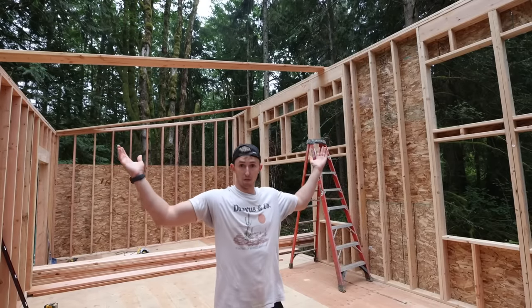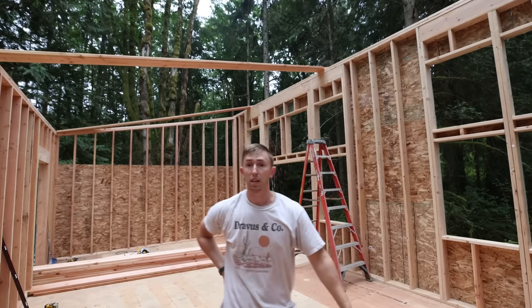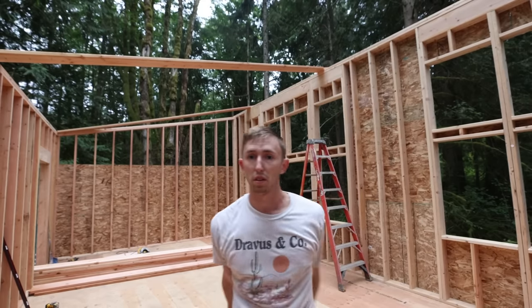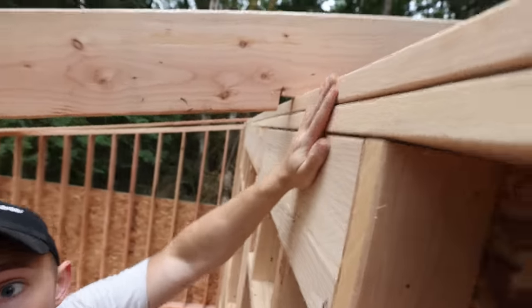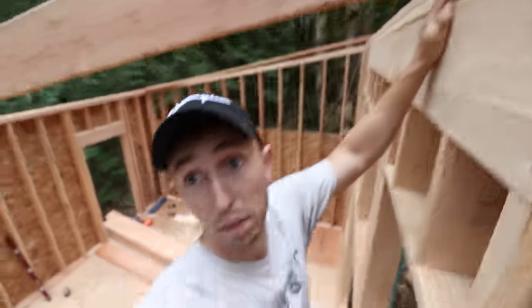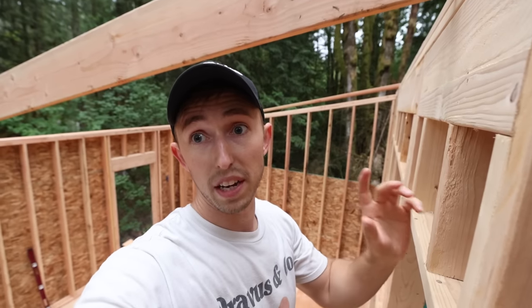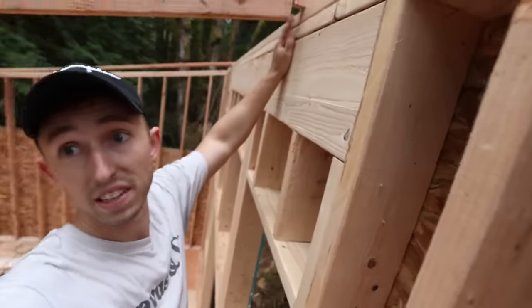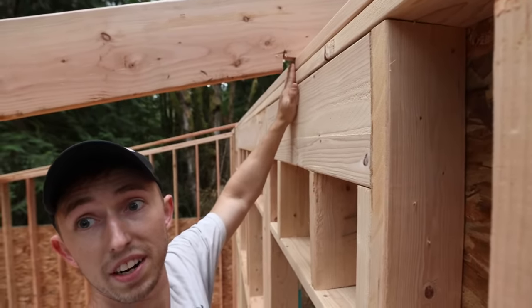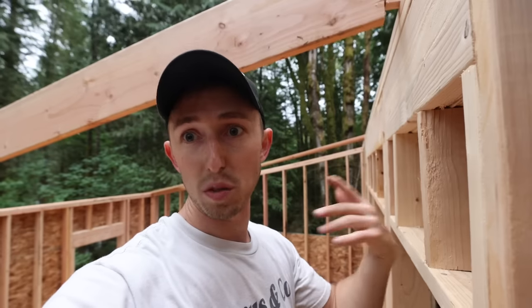I thought these walls flare out a little bit at the top in the middle, so I think I'm going to have to ratchet strap them and pull them together a little bit because I gave the wall jacks back to my co-worker. The other side over there, the little widow's peak is set directly on the wall, but this one has about an inch and a half gap — when I measured plumb I did see the wall leaning a little bit this way. So I'm going to take a ratchet strap, anchor to the floor over there, and try and pull this in. Once I get it sucked in to the point where this is flush, I'll go screw these in and that'll be our first establishing point, and then we can start mass production.